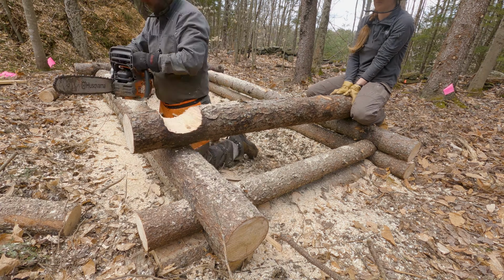The approach I used was to basically just grind away a little bit at it. Cut some slices out and grind away. I don't love running the chainsaw at low RPM for that long, but it seemed to work. The chainsaw made fairly quick work of each cut. And honestly, the cuts weren't as hard as I thought they were going to be. The hardest part is just approximating a semicircle in your mind as you're cutting, bearing in mind you're doing it on a curved surface that curves the other way. So it messes with your head a little bit.